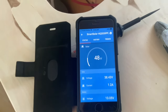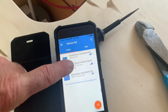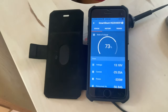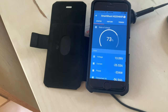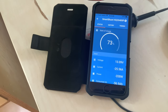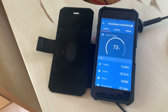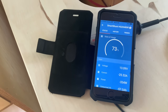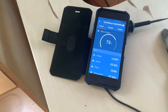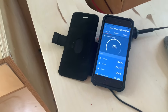Just 48 watts coming in from solar - if it was sunny I'd be pushing close to 250 watts. I went online and found the calculation: for two and a half gallons of water at 300 watts, heating from 18 degrees to 90 degrees - which is what I set the thermostat at - it's about 35 minutes. I've actually already done this once and it took not quite 40 minutes to come up to 90 degrees and turn off.